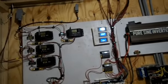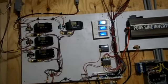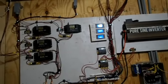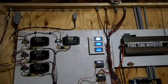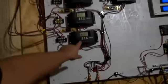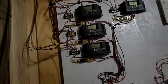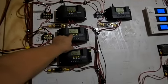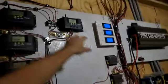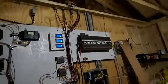We have 4.4 amps going out on 110, and on the 12-volt system we've got 5 amps going out. Solar to batteries right now is 17.5 amps. So everything's looking good. The east is at 4.79 amps, the roof is 6.39 amps, the west is 1.8 amps, and the other roof is 2.5 amps. So everything's charging.